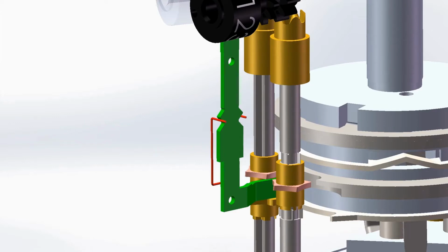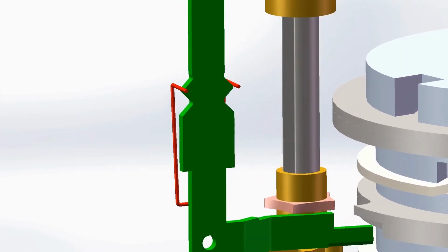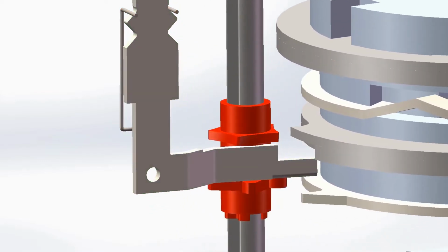As the carry is initiated, the pin pushes the carry lever into the down position, where it is locked by the carry lever spring as before. The carry lever's arm is sandwiched between the tens gear and locking assembly on the next higher transmission shaft. This assembly consists of 3 spacers, a lock gear, and a count gear. We'll focus on the count gear for now, since it performs the carry operation.